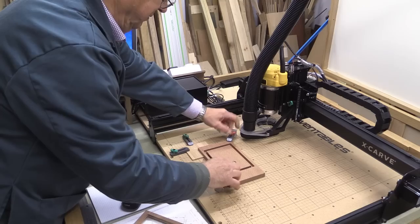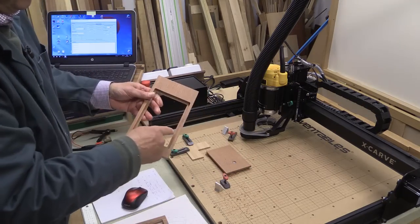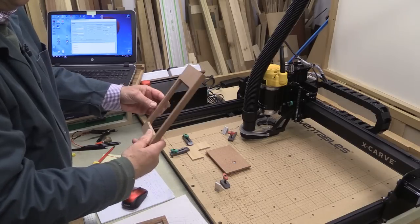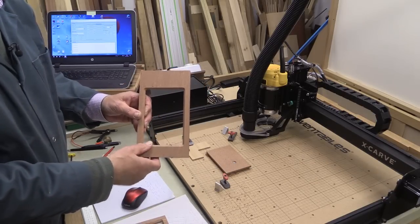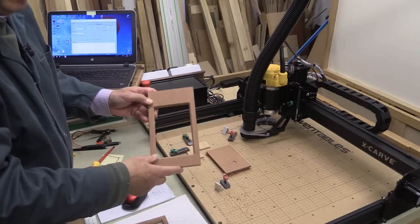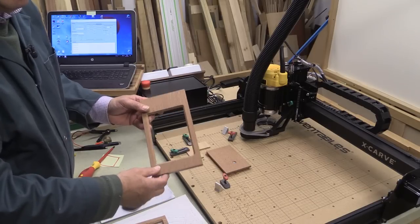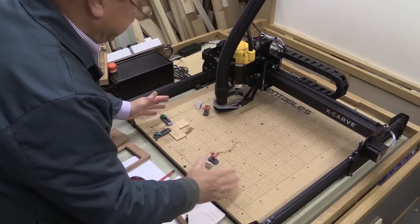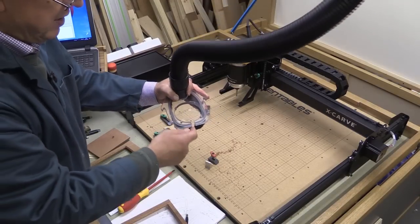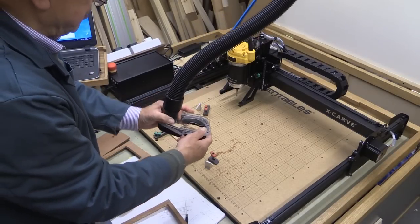On the screen it says job complete. And there you have my shape — this is where the piece of glass will go, and the backing piece which is just simply cut on a saw. It doesn't need to be cut out with the CNC. The total tool time was probably around about 6 minutes for this, and the actual total time if I wasn't filming would probably be about 15 minutes total. Now let's just look at the amount of dust that's escaped — there's a little bit here, but all this would be solved if there was a way of closing the gap for the bristle at the back.